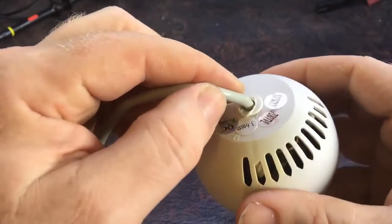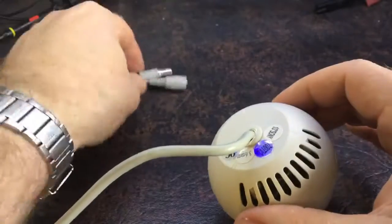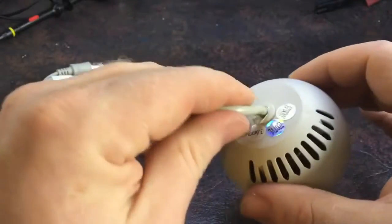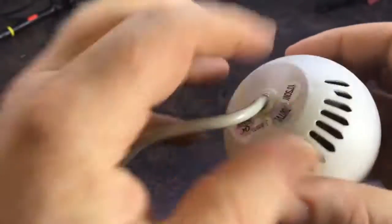What I suspect is that the distortion and ghosting on the screen is because the wires are not properly connected inside and you're getting DC pushed through the video signal. That's my guess, based on the fact that this cable is melted, which means it must be getting hot.